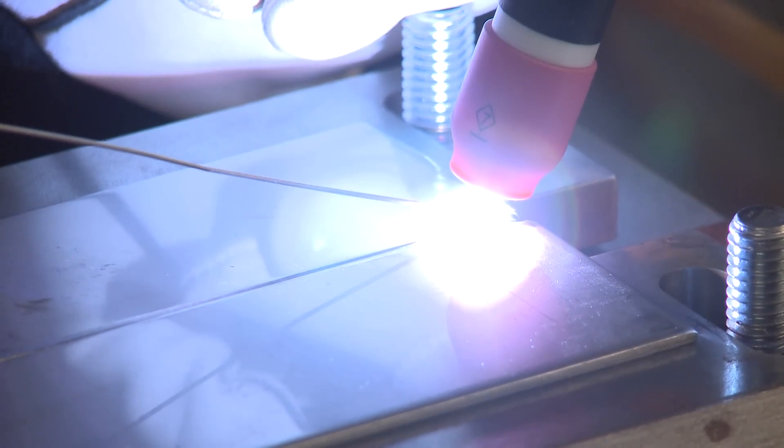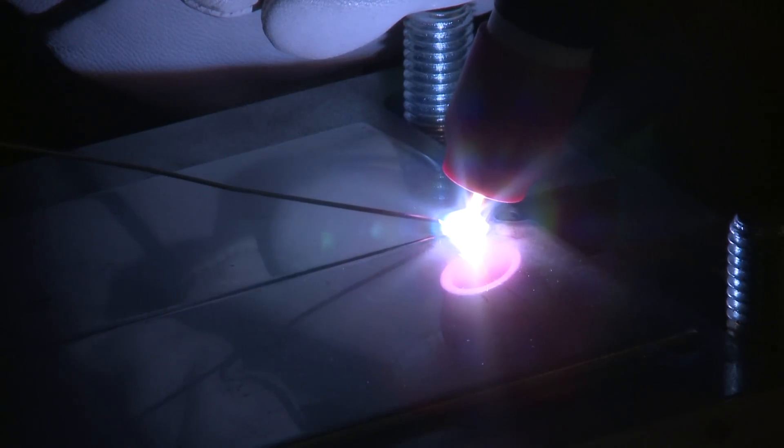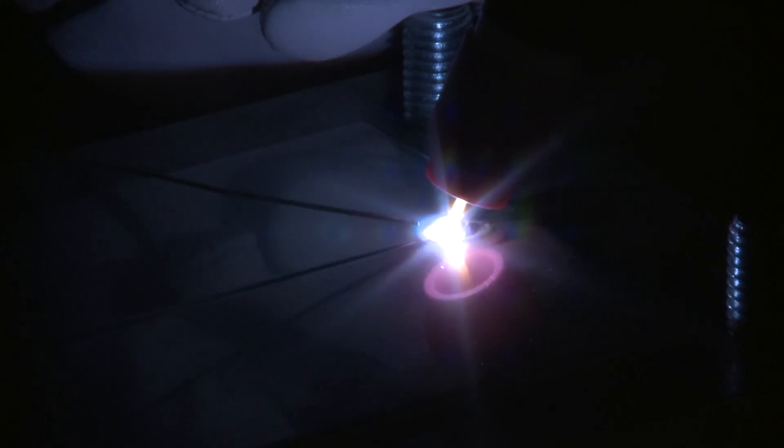It initiates very cleanly. You can see that puddle — real shiny. And I'm just dabbing a little bit at a time. I can see that I'm starting to penetrate. This particular weld does not have gas backup, so the likelihood is there's going to be a few oxides on the backside — we'll show those to you a little bit later. The top side typically welds pretty nice. Then finishing the weld, reducing my amperage, and making sure that the crater does not fill too low. And we're finished.